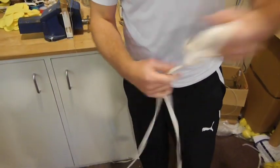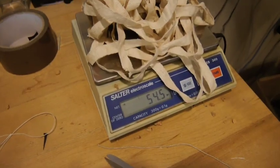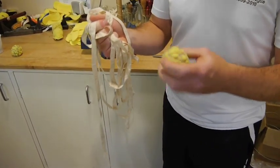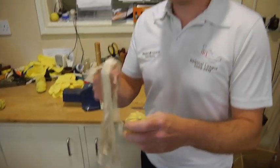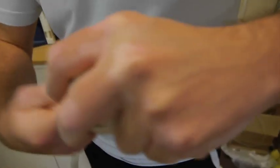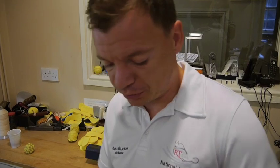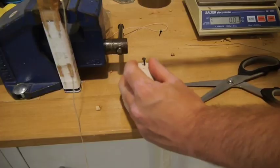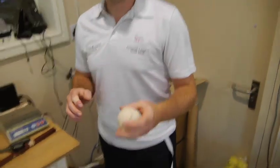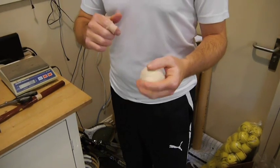It's just cotton bedding tape, and it's pretty robust and strong. The ball and the cotton tape should take the ball's weight up to 58 grams. Now I have to get the cotton tape wrapped around the core equally so it's very spherical — no bumps — just trying to cover it, pulling it very tight. This is a bit of an arm burner; you can't really make more than four or five a day. It's pretty tight, but now I have to hit it with a hammer to loosen it all off, then start pulling it again even tighter.